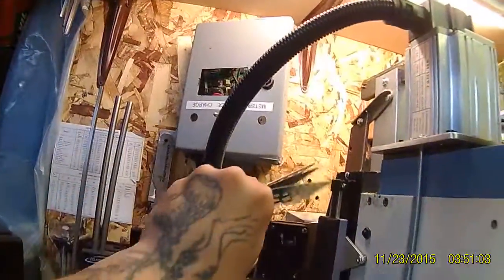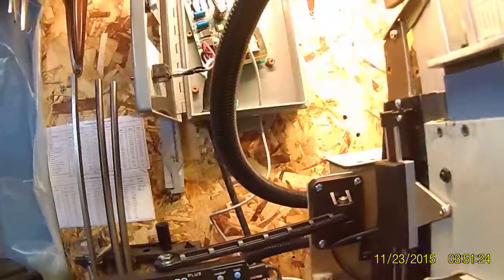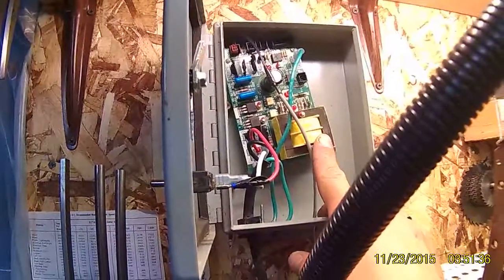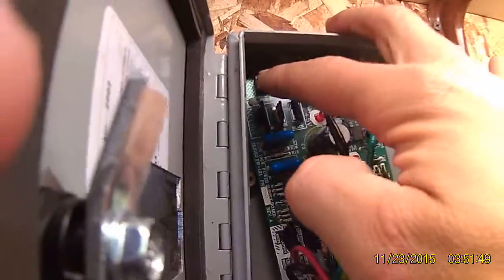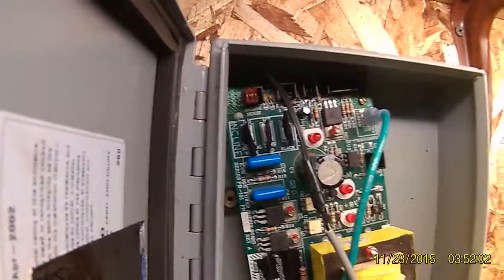Let me show you the box — I chopped it up. I originally got a nice little suburban propane furnace and this was the original box for it. I had it for a flip-on circuit last winter so when it got cold I'd go turn it on. I think I'll put an actual thermostat on it this year. So this is the treadmill power supply. The one up here says ground, five volt, and incline sense. Both outside pins are five volts and the inside pin is ground. The next one over is ground, five volt, tach.